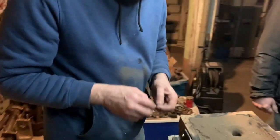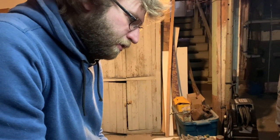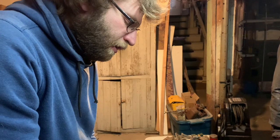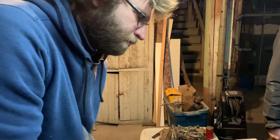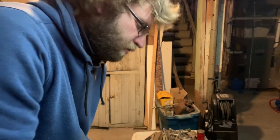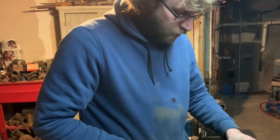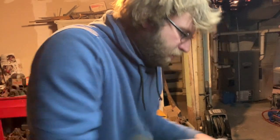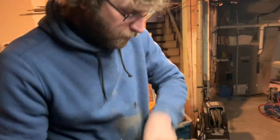For anyone curious, we're using green sand here — sometimes we use Petrobond, sometimes green sand. This is green sand with bentonite; I honestly forget the exact ratio, but for 100 pounds I think there's a gallon of water. We're using 70-grit sand — it's actual proper foundry sand we buy from one of the local foundries here. They're pretty cool with us and let us buy small quantities.